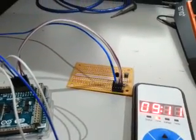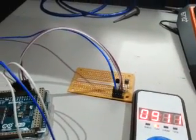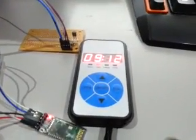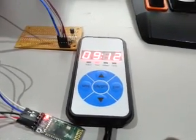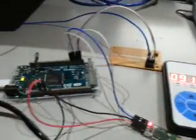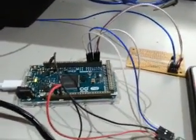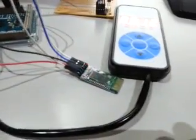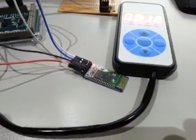Over here I have the Arduino. Here is a little circuit board to implement the transistor multiplexer, which we've hooked to the blue wire - you can see it trailing off over here - which is hooked in between the controller, which some people call the iPhone controller, I prefer LED, whatever floats your boat. And the other aspect is it's got another serial port on the Arduino hooked up to an HC-05 Bluetooth module.